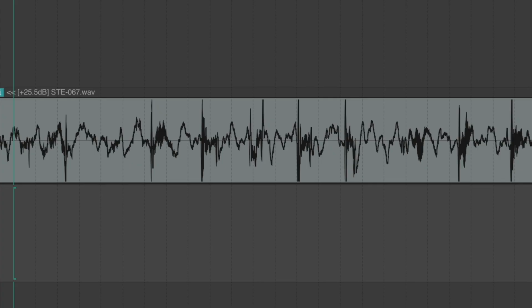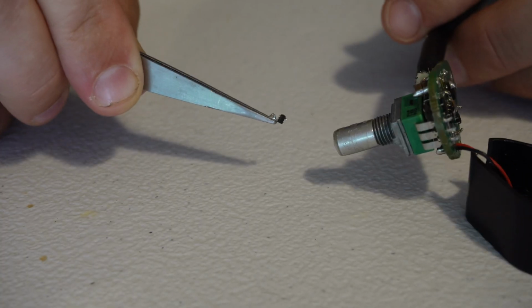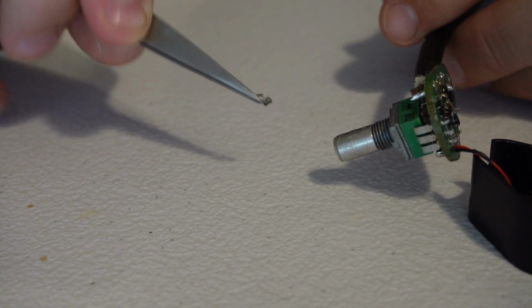Hold up! Indoor mic here, chiming in. So that did not sound like it was operating normally. And in fact, the waveform is quite screwed up. There's all this kind of weird high amplitude noise that I can also hear very clearly in the recording now that I'm inside. And in fact, it turns out that this one chip on the circuit board was completely fried, and I had to replace it. And once I replaced it, then it was working normally.